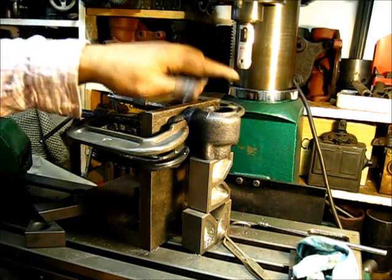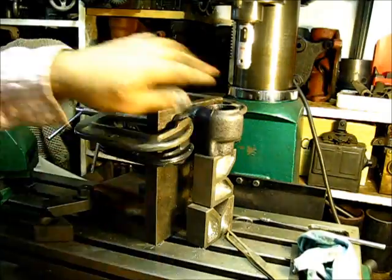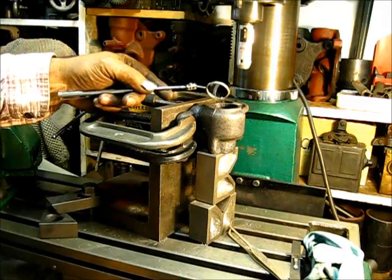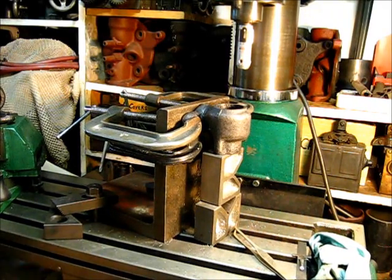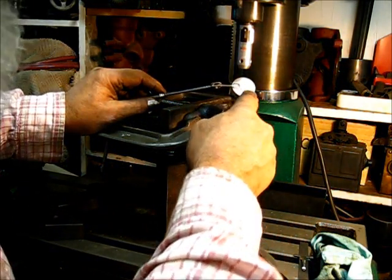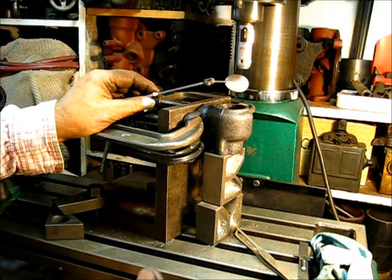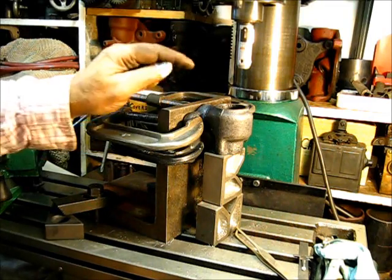You turn it around to where that little dot is and you've got a little laser right there. You traverse the table in whatever direction you need while observing with the mirror the end of the — it's brilliant. Sometimes you just have to kind of laugh. You see the little dot. When you get that little laser point in the center of that rivet down in there, you know you're within a few thousandths — much closer than the as-cast housing.